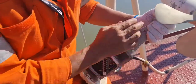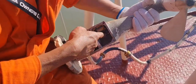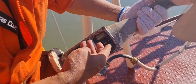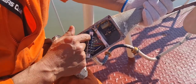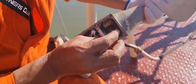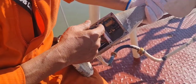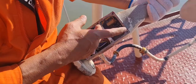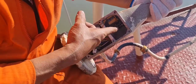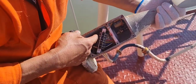The servo motor here — you see this slip ring — produces AC output. Terminal one and two are connected here to the slip ring. That is a slip ring, very small. Not exactly a carbon brush or a slip ring — usually when we talk about a slip ring there is a carbon brush, but here there is no carbon brush, just a brush itself. From there it transmits to this terminal the output of this generator.